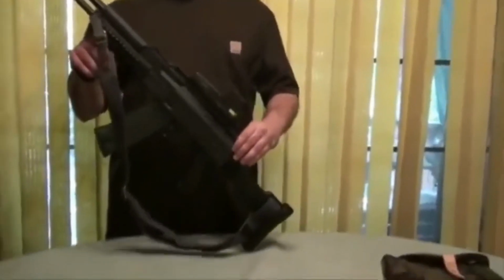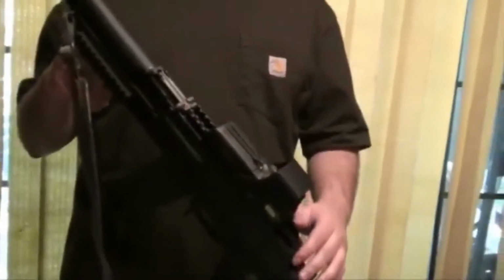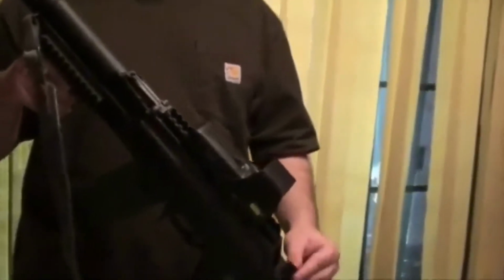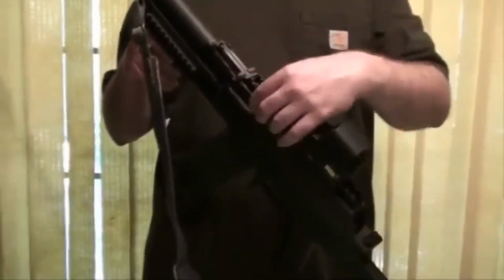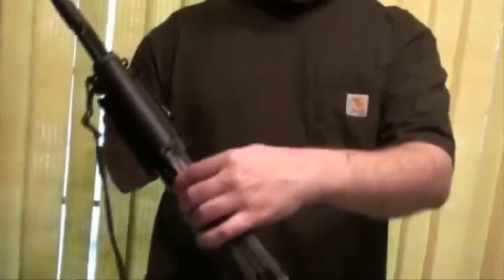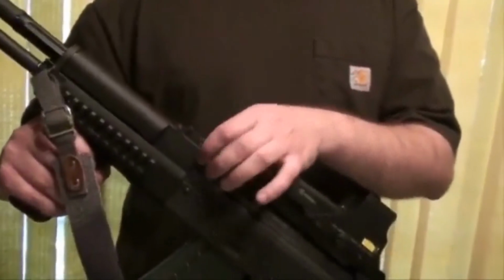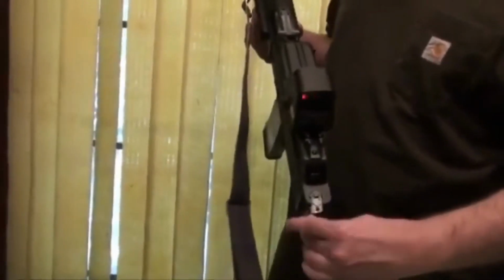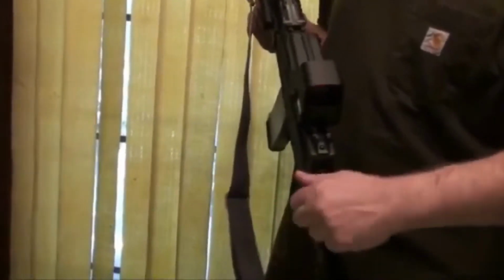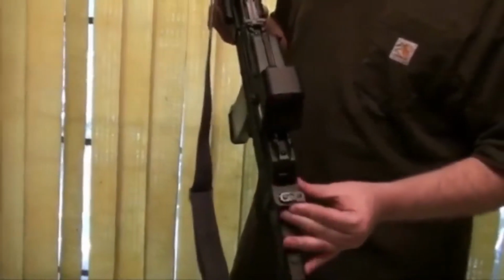This rifle also came in with this Generation 4 scope mount rail, or POPC, as the Polish call it. It locks onto the gun in 3 locations, 2 mount up here. It's a system that more than a few U.S. manufacturers have copied to some degree. Trunnion, or actually sight block. You can see the slot where that goes in, same on the other side. Back here there's a throw lever, somewhat similar to the original Soviet quick detach mount. You just flip it over and then pull your mount up and off. I do think that's a solid system, I really do, to lock it on.